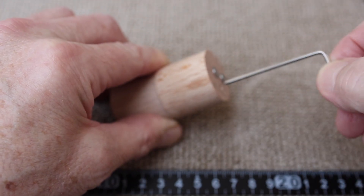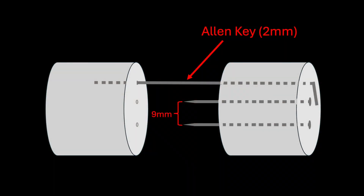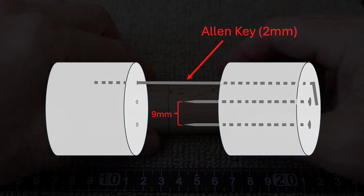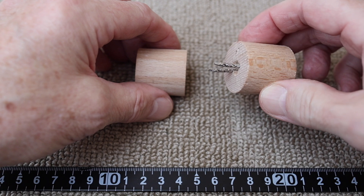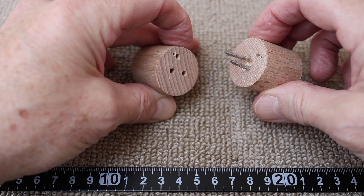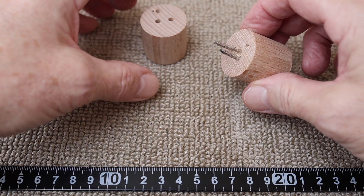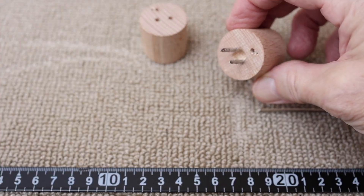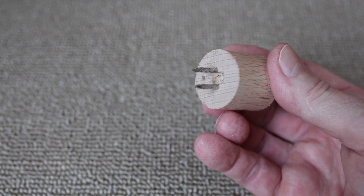There is no rocket science here. The only difficult part was pre-drilling straight aligned holes in the top dowel piece from end to end. This was challenging because I do not own a vertical mechanical drill press, so I had to freestyle it using a simple hand drill, but I accomplished it on the first try regardless. I made one mistake which actually turned out to be fortuitous — I figured it would be good to minimize the protrusion distance of the nails on the working end to minimize any flexure or instability, but I accidentally used nails that were a bit too short. The nail tips did not reach the adjustment holes because the brass protrusion of the worm gear was contacting the wooden dowel between the nails and preventing them from reaching the spanner holes.